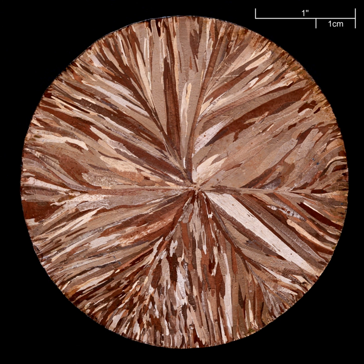Demasking is the combined process of clearing the part of etchant and maskant. Etchant is generally removed with a wash of clear, cold water, although other substances may be used in specialized processes. A deoxidizing bath may also be required in the common case that the etching process left a film of oxide on the surface of the material. Various methods may be used to remove the maskant, the most common being simple hand removal using scraping tools. This is frequently both time-consuming and laborious, so for large-scale processes this step may be automated.